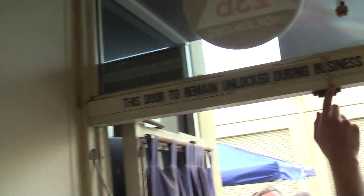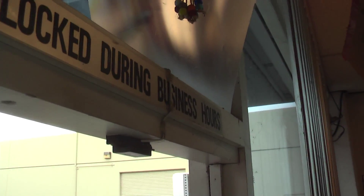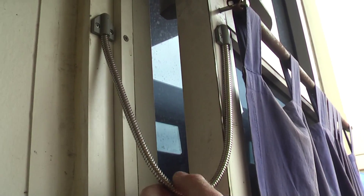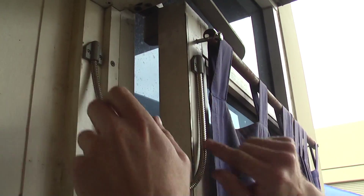These are all things that are good to have. You can customize your software to tell it what's what. You may just log motion detector hits to detect if people are in the space - for lighting and heat - but not necessarily take action on it. This is a magnetic reed switch. There's a magnet that closes it; when the door opens, the magnet leaves. This is not a camera - not a camera at all.